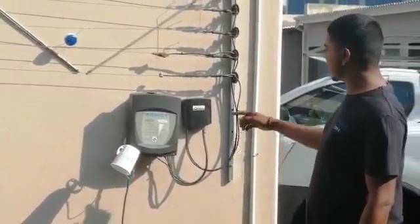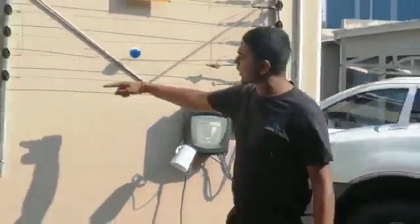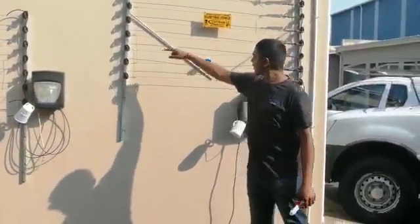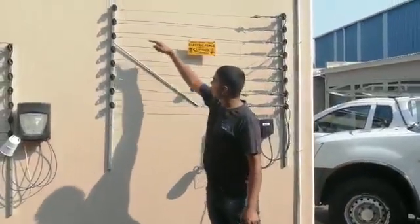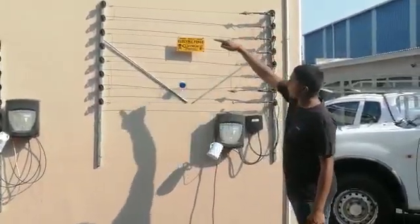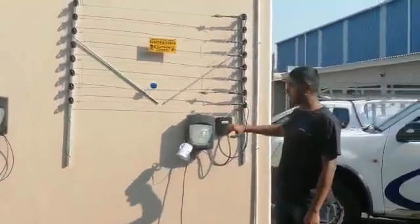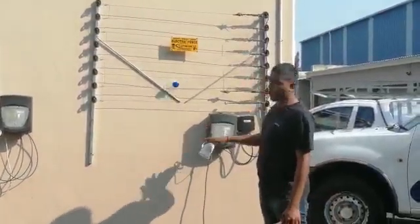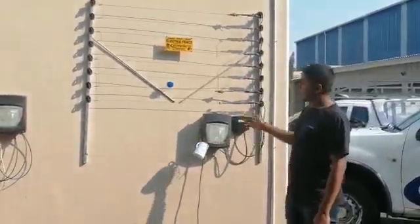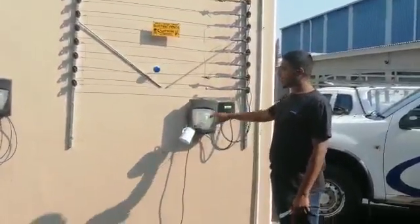What we want to demonstrate now is a series fence. In this fence, the power direction travels on the first wire along here, loops up to the third wire, comes along this way, goes back up, comes along this way, goes back up, and effectively returns to the energizer — that's a series connection. If you cut any of these live wires it should trigger your alarm. That's how an electric fence should be installed.